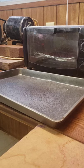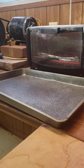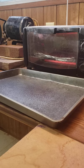When you put them on the tumbler you got to let them tumble. If you use the Harbor Freight one it takes all night long — 8, 10, 12 hours. You use that big homemade one I got right there with the big fan motor on it, it spins them pretty fast. I can put 50 pounds of pellets on that thing and it'll spin them. You can do them in less than a third of the time and they'll be just as glossy pearl black as they could be if you leave them on for four or five hours.